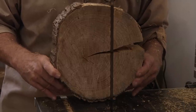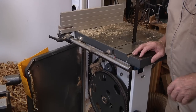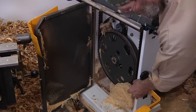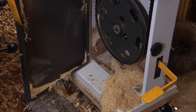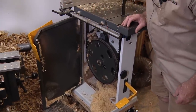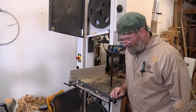It doesn't do any damage to you, but it makes a lot of noise. One downside of standing your blanks on end and cutting parallel to the grain is you're going to get a lot of hair balls in it. Not a problem really — they just don't go through the dust collector very well, partly because of the long fibers and also because dust collection ports on bandsaws are very poorly designed. But you have to clean out your bandsaw and get those out of there.